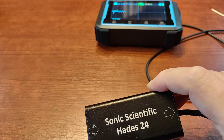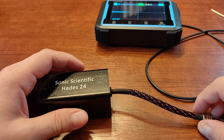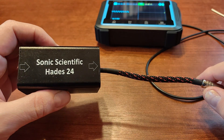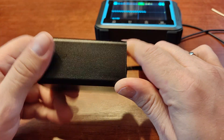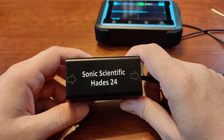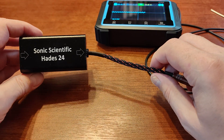At $18 and $12, I can wholeheartedly recommend both modules. They do act as capacitor power banks, so if your power supply was weak — not just noisy — you'll hear additional gains in dynamics and bass power, since low frequencies require higher current. You could build something like this yourself with a power socket, a plug, and a bank of capacitors, but a ready-made unit will likely be cheaper and more convenient.